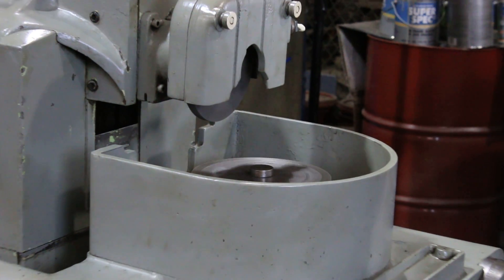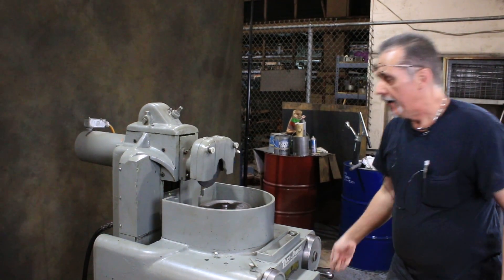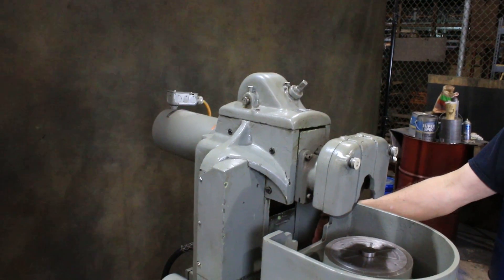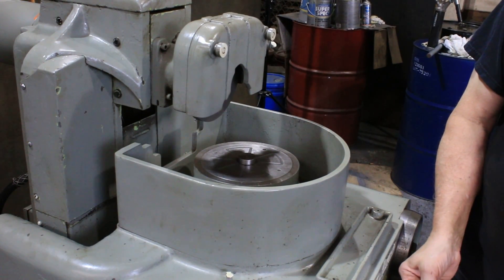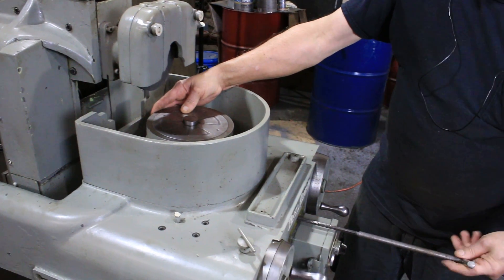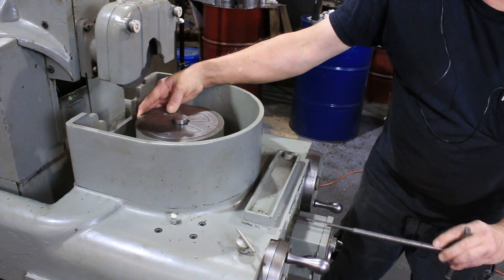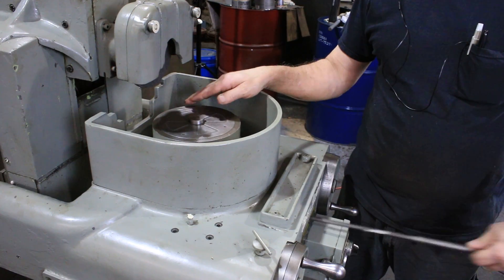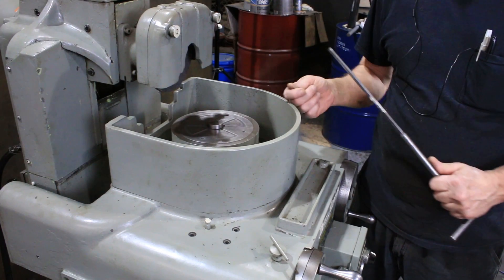The other thing I'd like to show you — I'll just stop the chuck — is the tilt on the table. It's kind of neat. The table pivots on an axis and it's captured between two Allen set screws, one in the rear and one in the front. I've already loosened the one in the back. You just put your wrench on the front one and you can actually see it will tilt — you can crank it forward and backwards. You can change the angle on it. It'll tilt more than that; it's just a question of where you have the set screw set. You can set it where you need it, indicate it, lock it down, and you're ready to go.